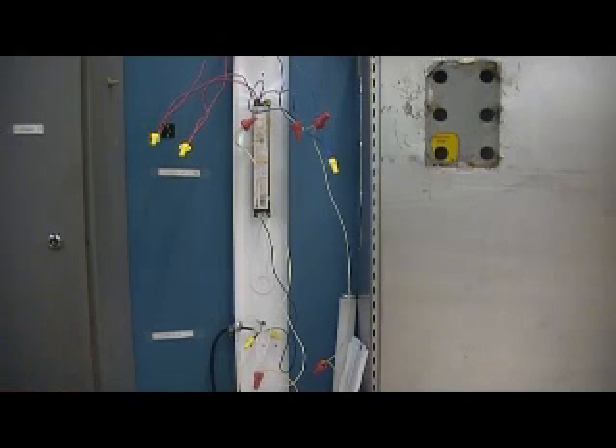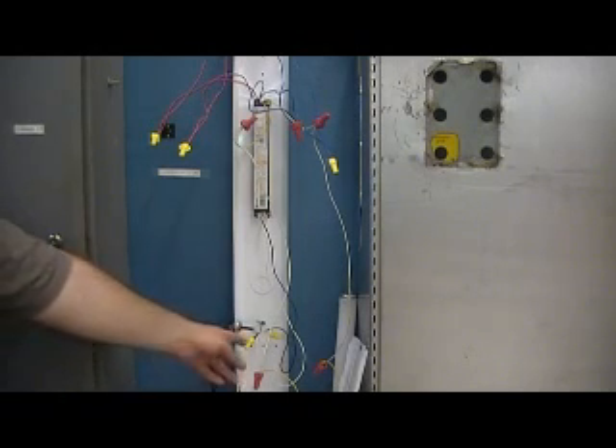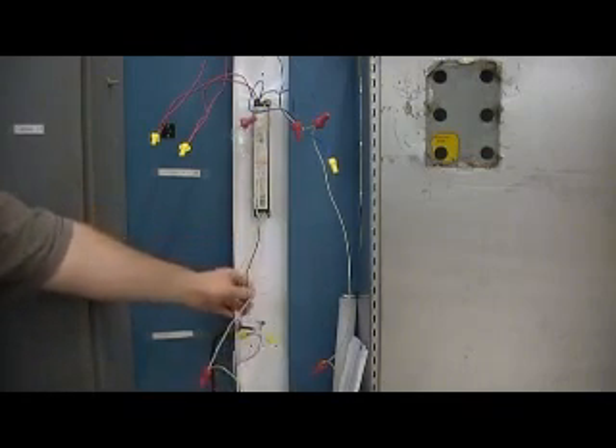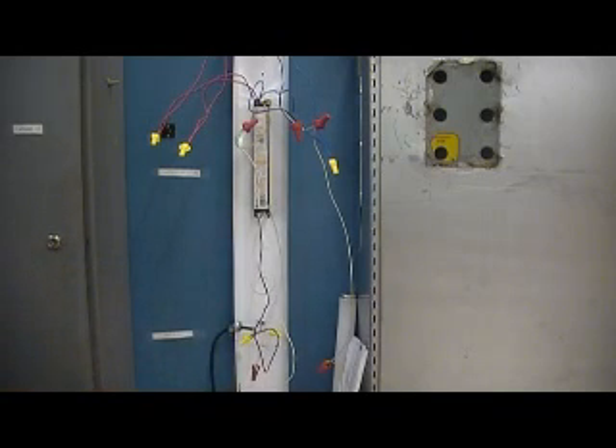The process to change it is pretty simple. Down here you have your power coming in — 120 — so on the ballast that is black and white, just like we've been looking at. Black is your hot, white is your neutral. In typical applications you will have to wire this up hot, because this light will be in a group with many other lights, maybe 10 to 20 lights. You can't shut down all the lights — in a plant you can't cut all the lights out while everybody's working and production's running.